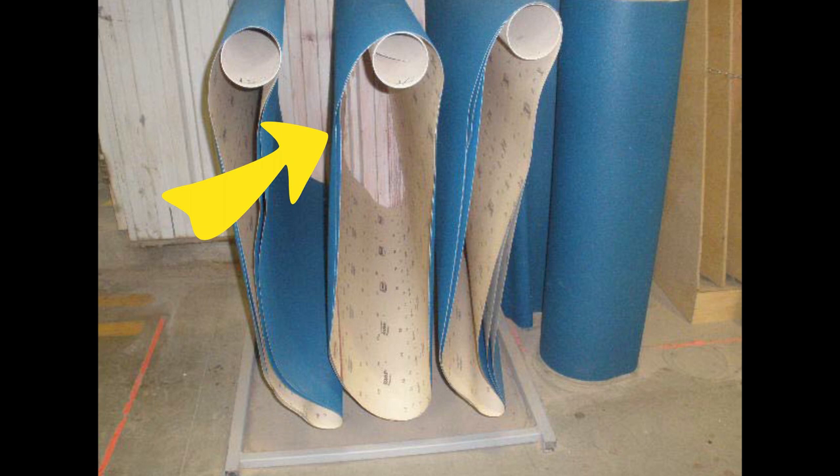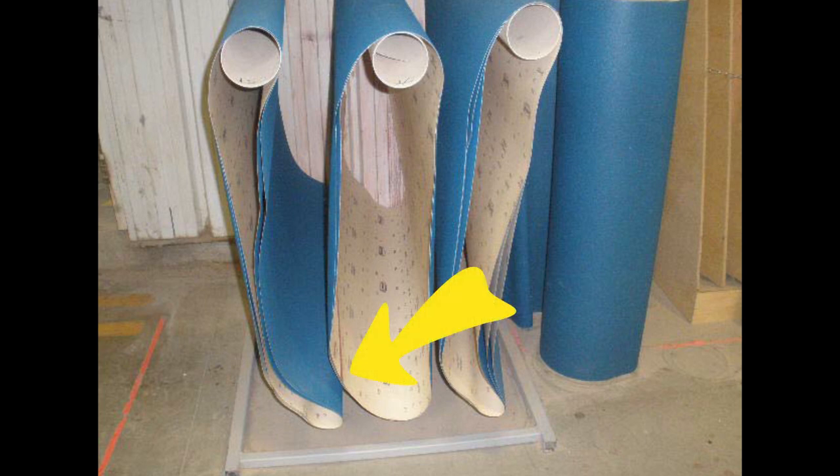You can even improve this process one step more. As you'll notice, this wide belt is rubbing this one, and that's another big problem with wide belts. You do not want grain rubbing against grain, because what will happen is you're likely to fracture some of that grain and then you'll end up getting raised lines when you run the belt because some of the grain has been broken off.